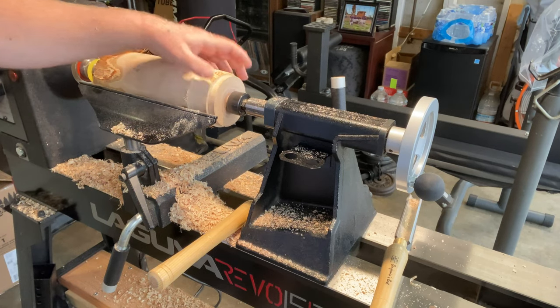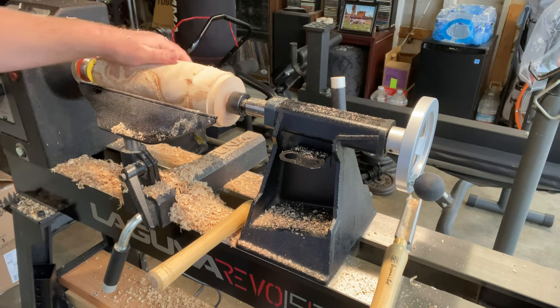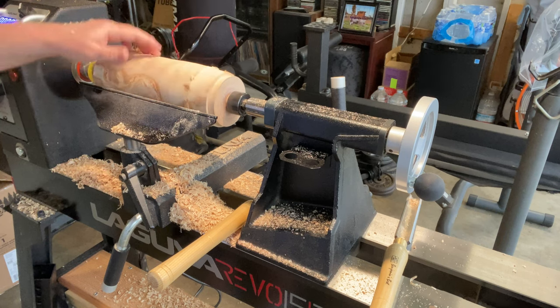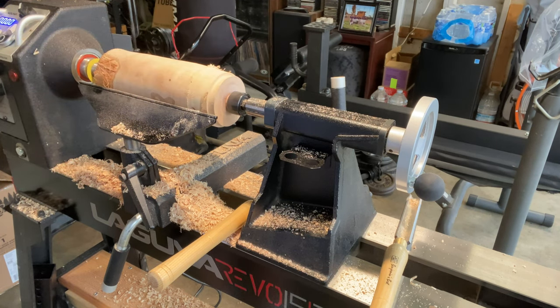They're a half inch tenon, dovetailed, roughly 13 degrees for those power grip jaws. Anyhow, obviously I got some more rounding out to do, but I just had to button up this tenon before I move forward.